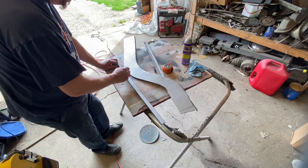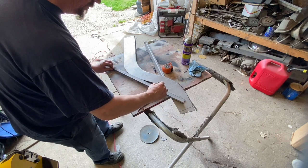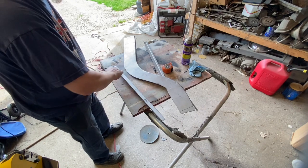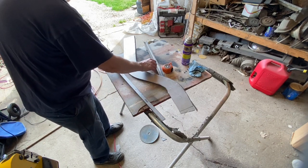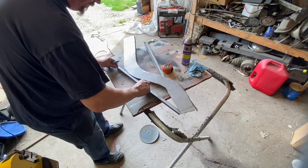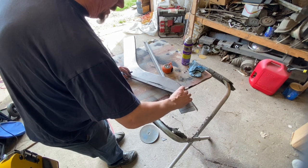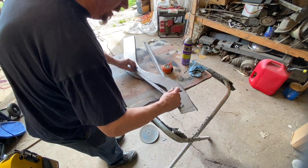need to shrink in here, and we're going to need to stretch up in here. So as we put this in the shrinker stretcher, we will have a good feel for how that works. I guess I also want to kind of roll that up and say I'm probably going to stop shrinking in here, and I'm probably going to start stretching from here to probably in here-ish.